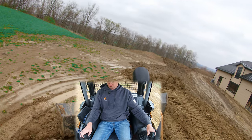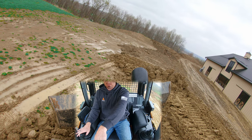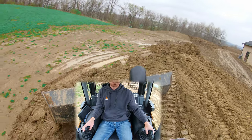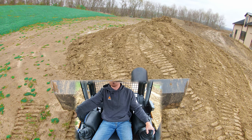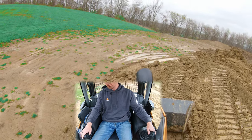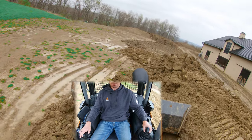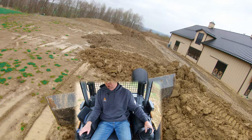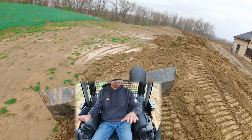I'm going to tilt just a little bit, and we are angled away. Right here we start to run out of material — you've got to pay attention, because if I keep going I'll get myself into trouble. So when we run out of material, we're going to back up and do another pass. Notice how much we're leaning right now — that's compaction on that material. Now I'm going to trap this material because I don't want to spread my pile further out to the left. We're going to trap the material, go in with a steep angle, and pull that material in towards the pile to build my slope. Then we're going to angle back, give it a little shake to knock material off, and continue to round this pile out using our blade to manipulate where we want the material to go.